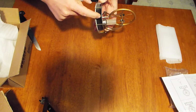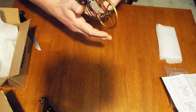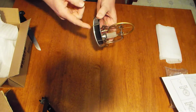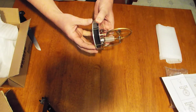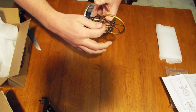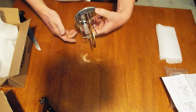What you have is a displacer piston. So there's air inside of this cylinder. And this cylinder is the power cylinder. Okay, yeah. So what happens is these two plates, there's a temperature differential. So this plate is hot, this plate is cold, so the air flowing between this displacer piston will heat up and expand, causing this to move up, and then as it cools, it will contract, pulling it down. And I think that's how that principle works.